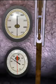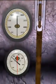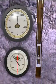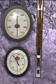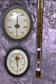Pick up and slack off weights are determined and the liner is run into the open hole. Bottom is located by observing a repeatable drop on the weight indicator. The liner is picked up off bottom and the wellbore is circulated clean to remove any cuttings from the annulus.